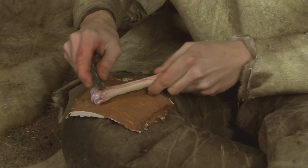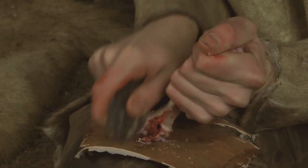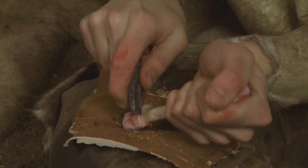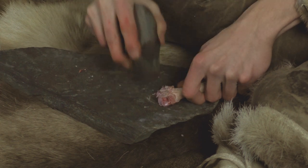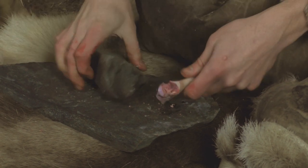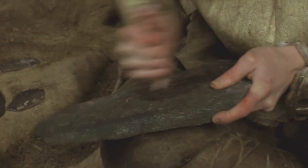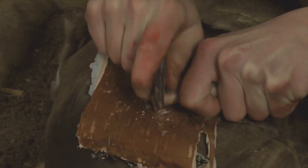The surface of the bone is scrubbed clean. A groove is sawn at the head of a bone with a flint blade so that the head can be broken off at the desired place. The head of the bone is loosened by striking it gently with a hammer stone. The broken end of the bone is smoothened using a whetstone. Loosening the other head of the bone — the grooves are sawn first and then they are struck.